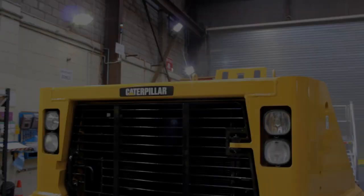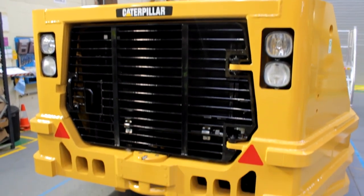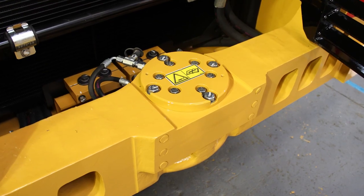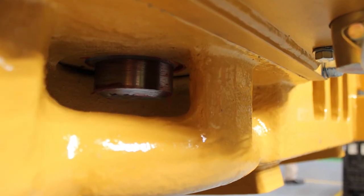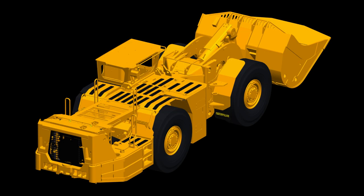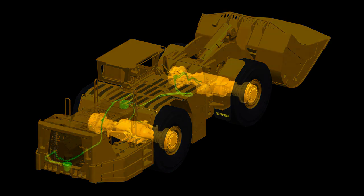The two options are: Brake Release System Recovery Bar and Brake Release System Recovery Hook. The Brake Release Recovery Bar System incorporates an independent brake circuit, which when activated using the bar recovery tool, releases the brakes allowing the machine to be retrieved and brought into a safe working area. The system consists of a lines group to each wheel and an activation piston, which when depressed using the bar recovery tool, charges the brake circuits with pressure, releasing the spring applied fluid release brakes.